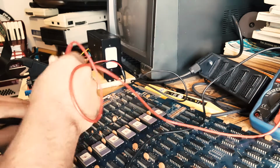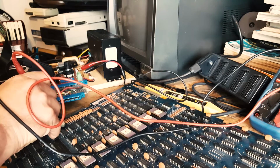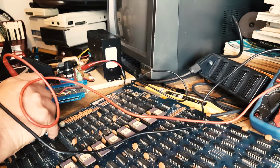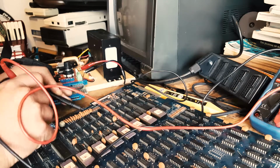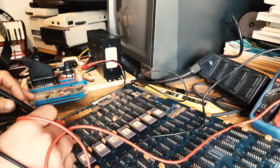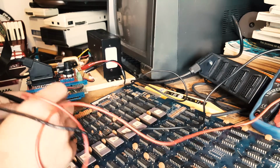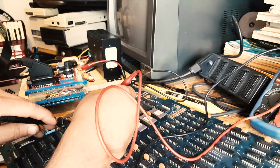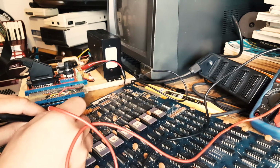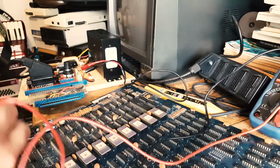is this the ground then? Is it the ground side? No. This side should be ground. Except for those two. That's interesting. So this side is connected to ground, except for these two. I can see the big tab here, grounding tab. Anyway, so this guy, this side here should test that. Well, actually, it's going to register to ground. This guy is shorted, but this side I assume should be connected to 12. Because it's shorted, it's actually sending a low signal as well as the natural high state. So this is why we were seeing this toggling between high and low.